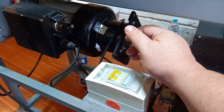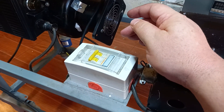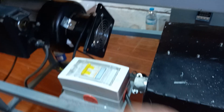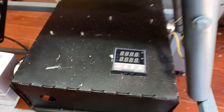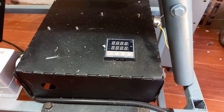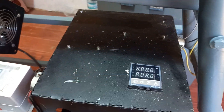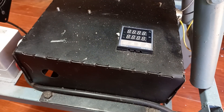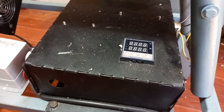Overall, everything in here is controlled with a circuit breaker — this one is 16 ampere double pole double throw. The temperature controller is a REX-C100 K-type thermocouple temperature controller, which you can buy online. Inside we have a bus bar to distribute the electrical current onto the various parts of the machine.